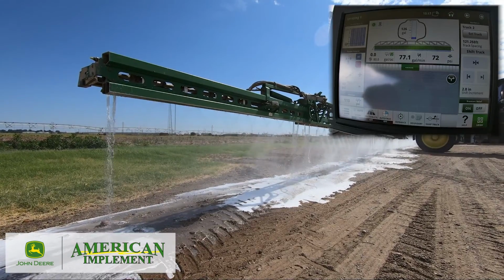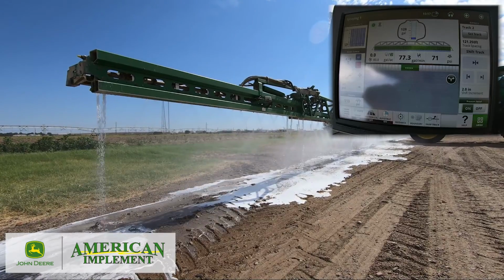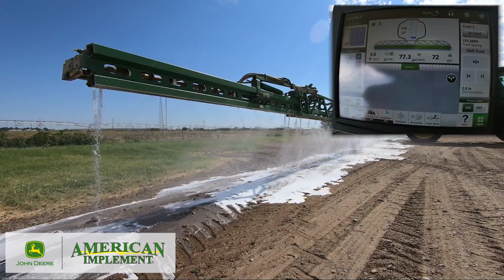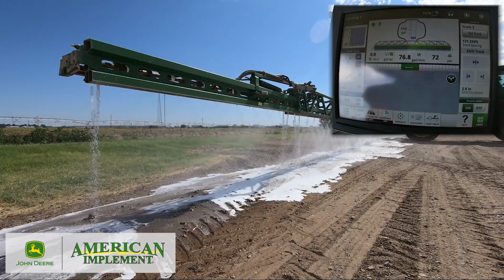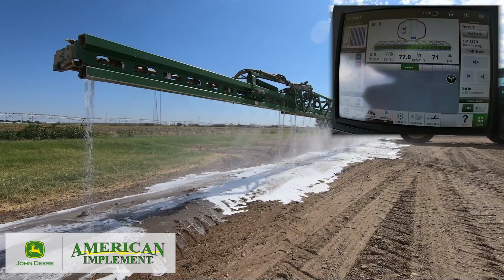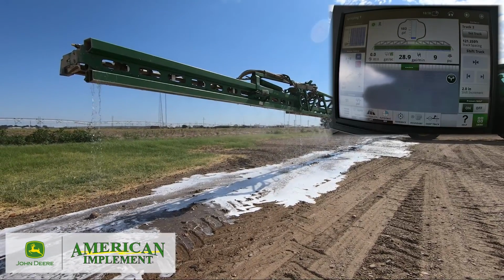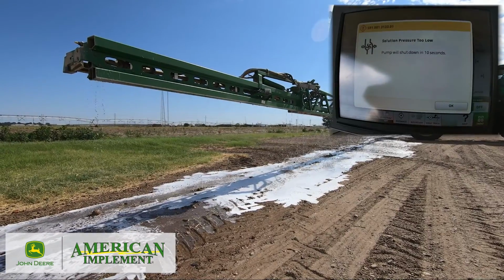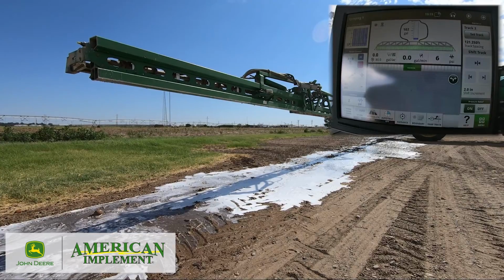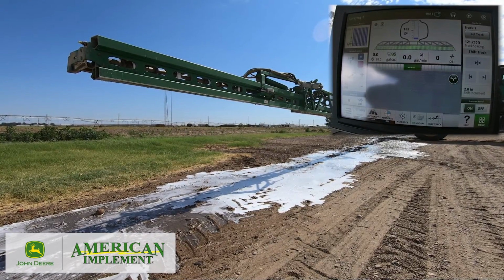This way I get all the tank cleaner out and make sure that everything is the way it should be for the rest of the time. So once my pump's empty, I'll lose pressure. I'll shut my pump off, my spray off. Now the only thing left to rinse out is my fill, side fill.